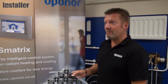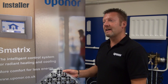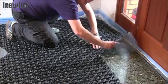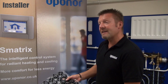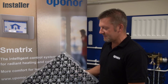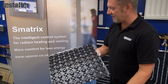The floor is prepped first and foremost and sealed to get rid of any dust. The panel is then physically laid down and adhered to that structural subfloor — peel off the back of the panel, very simple and easy. The panel itself is approximately 10 millimetres thick, and the pipe used with the Minitek system is 9.9 millimetres, which naturally steps into the castellations of the panel.